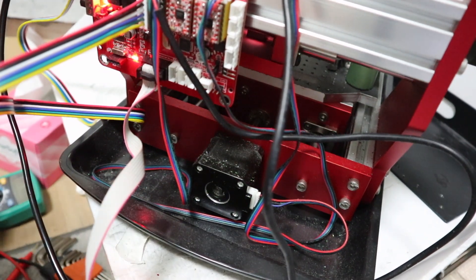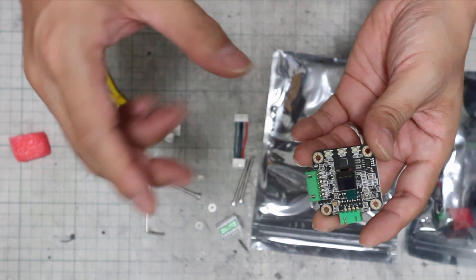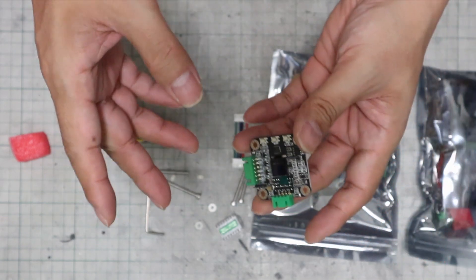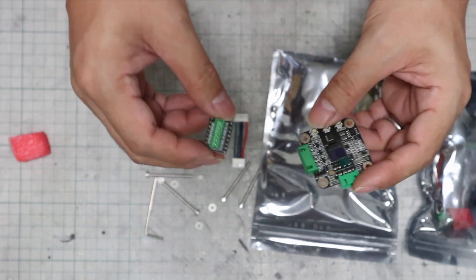So here it is — this is an encoder. The encoder is attached to the stepper motor to compensate for step-out. Simply put, an ordinary stepper motor becomes like a servo motor for industrial use. This overcomes the problem of step-out and greatly reduces machining errors.